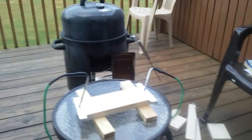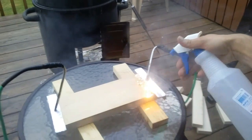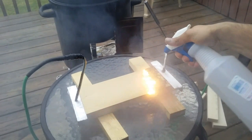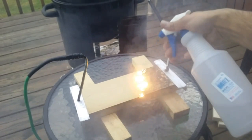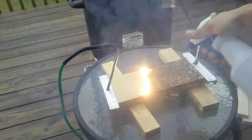What we're going to do here is I'm going to steer this with my spray bottle — it needs some help. What I'm doing is keeping the stuff that's already been burnt from getting over-burnt by saturating it, and at the same time I'm providing fresh electrolyte and just chasing it down the line.